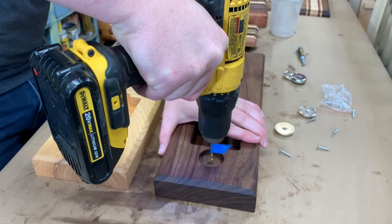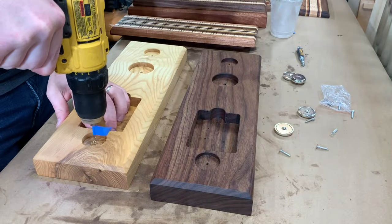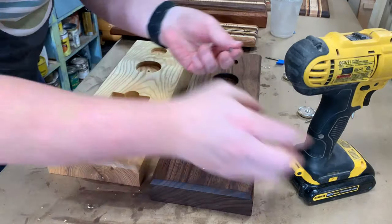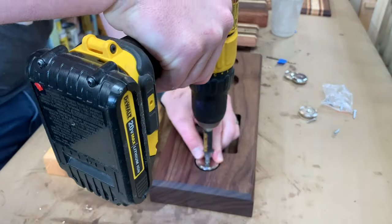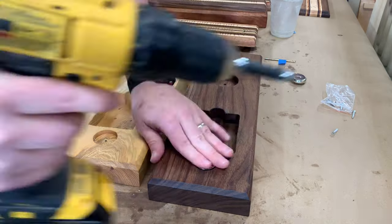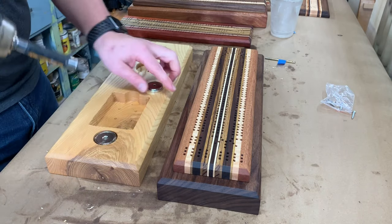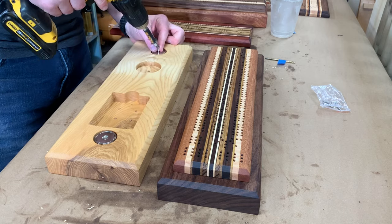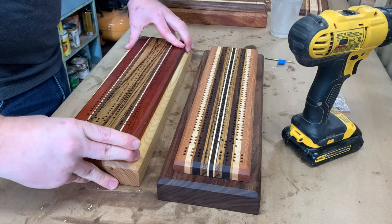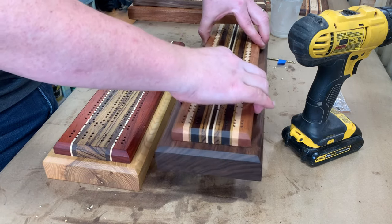Once the finish is down, it's time to add those magnets. If you didn't do epoxy earlier, now is when you would add them. With these heavy-duty magnets that already have a hole in them, just pre-drill — be sure to pre-drill so you don't split your board. Don't go too deep; use some blue tape to set a depth limit. Then just add the screw and it goes in — easy peasy. The board just works. The magnets work great, line up perfectly. Save this step for after finish.